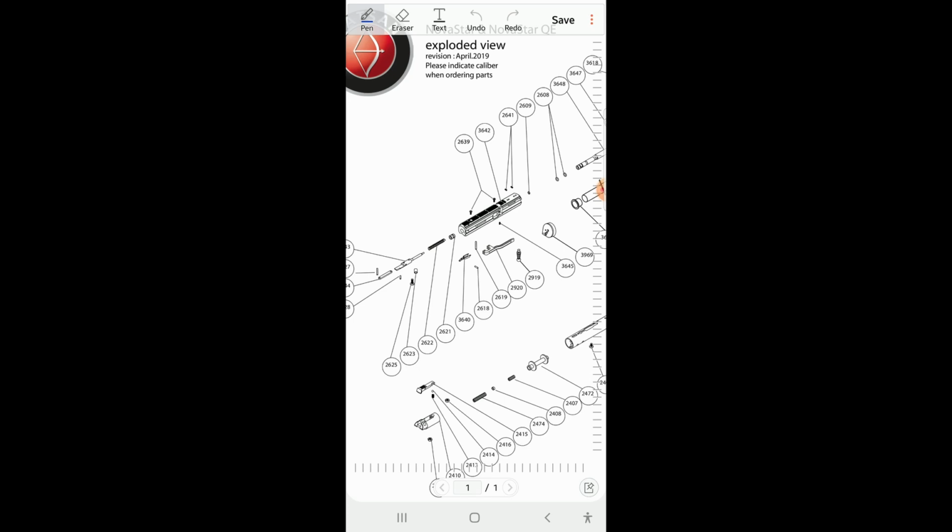But again, that piece is a two-part component, and what I was talking about was the left side was rubbing against the hammer. We didn't know that it was rubbing. We thought that out of the box, when we were firing our shots, maybe it just needed a little breaking in. So we put round after round through it to see if it would smoothen out. It did, but we didn't see the problem until that component failed and we tore it apart. One portion of the left side was rubbing so much against the hammer that it turned pretty much into a knife edge. It was very sharp, so we've smoothed that out so it doesn't get dangerous when we're handling it.